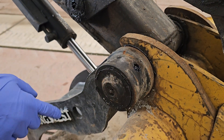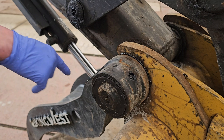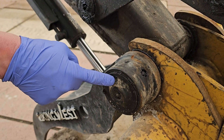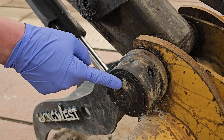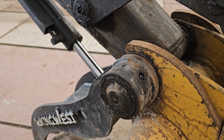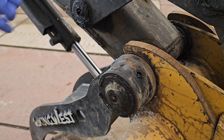The reason there are two options here is because this is an aftermarket thumb. Viking West has supplied their own greasable bushing, and they reused the John Deere pin, which is also a greasable pin. So it's just a mix of two ideas coming together. Don't worry about it — grease one or the other and you'll be fine.